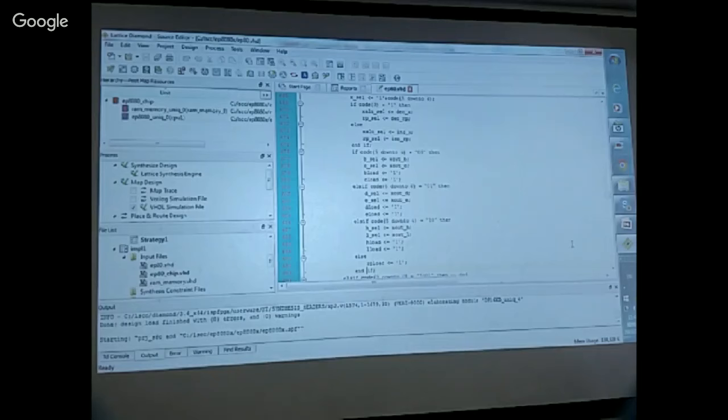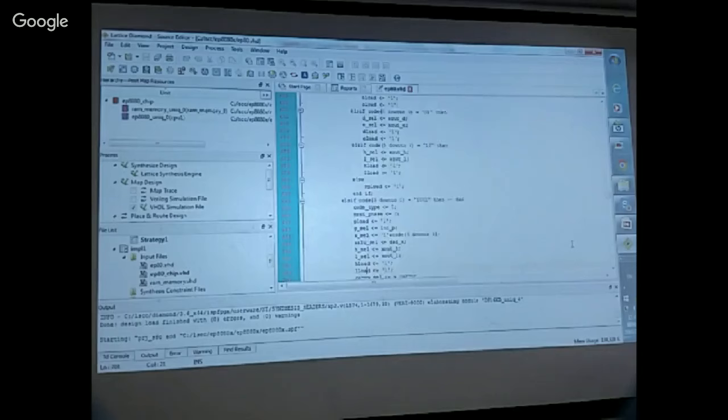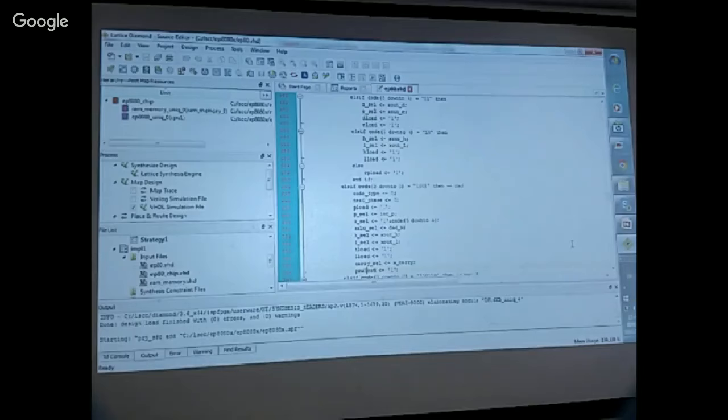Yes. There's one quite difficult instruction on the 8080, which is exchange HL with the top of the stack. Oh yes, that's easy, because the stack is on chip and HL is readily there. I just select the multiplexer in front of HL to the stack pointer, and select HL as the source for the stack pointer latch. One cycle. Then the exchange is only one cycle. All the other exchanges are only one cycle too.